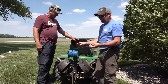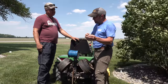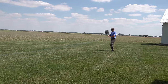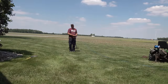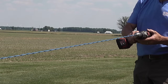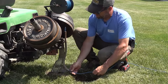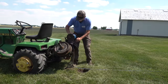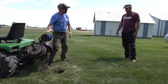We're going to persuade the dog not to leave the yard very softly. Now we're going to do a trick: in order for the wire to reach the perimeter without triggering the signal where you don't want it, we're going to twist two wires together. I'll show you a trick for doing that when you don't buy pre-twisted wire — what spins in a hurry real fast? A drill. I actually started twisting by hand! We'll make it a little easier. Just hold onto that end while I use the drill. Now I'll hook it on here with a piece of wire and spool it up, then pull it out into position with the plow ready to lay cable.